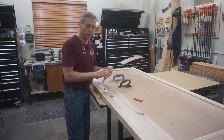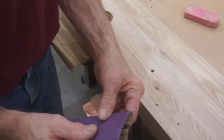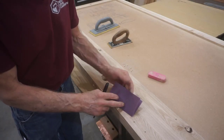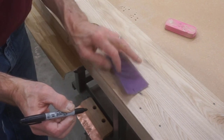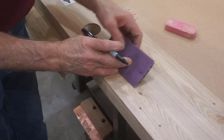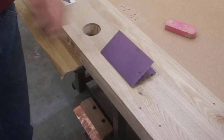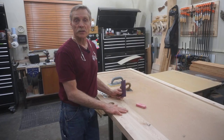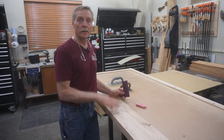Then the last step is to use a sheet of carefully folded 320-grit sandpaper. To get maximum use out of a piece of tri-fold sandpaper, I number the surfaces so I use them in sequence — each surface gets used completely and I don't waste time guessing which surface has the most sanding capability remaining. That final pass with the 320-grit sandpaper leaves a buttery smooth surface on the wood that I always want prior to applying gel varnish.